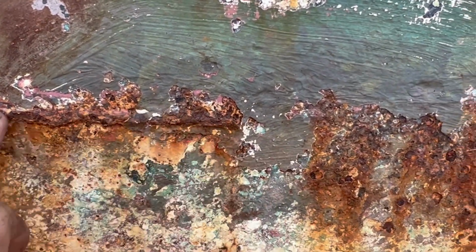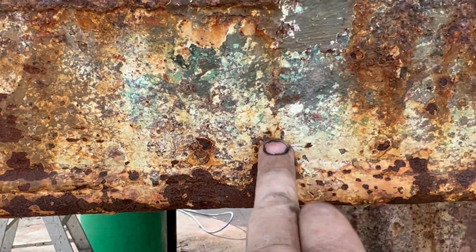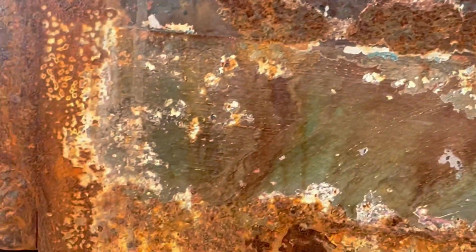And grind the weld out, redo the weld. There's plenty of material left, it's just all welded. And the holes are in the weld slag. So no other dramas there. I'll plug weld that one, and then take and weld all this up.